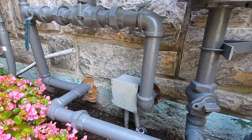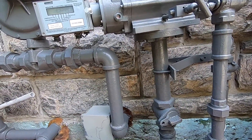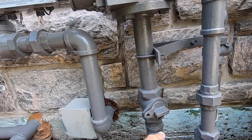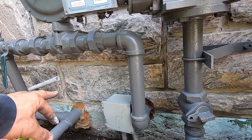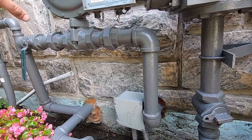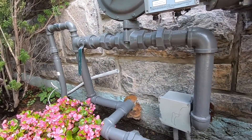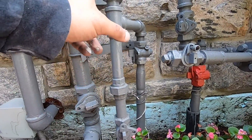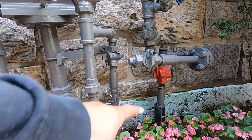Okay guys, gas is going back on. So my first guess is at this meter. You got the regulator here — bigger regulator. It's going here, and that's going straight to 2-inch where I am at 2 psi. That's branching off, coming back to another regulator, going inside the house. That's going outside somewhere to a riser. This is going to another riser outside. And that's the main coming in.